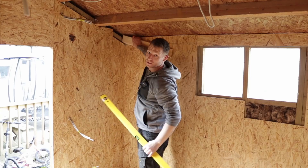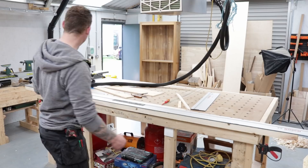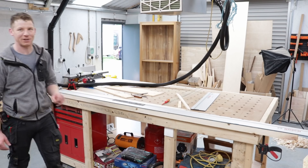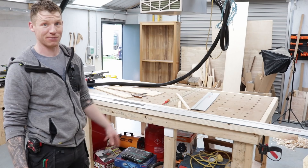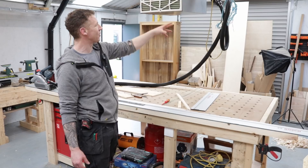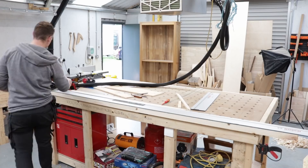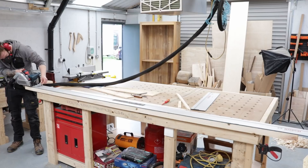I'm set up to rip here with the saw set to just under 20 degrees — doesn't have to be bang on, we're just getting screws in anyway. I have to say, for all the grief I give the Bosch track saw, today it has performed flawlessly. For ripping down sheet goods it's absolutely fantastic — it only suffers when I'm using it with an MFT table. I'm also hanging the dust extraction hose with a bit of rope, which really seems to help with hose management — finding that out today.